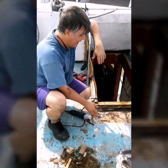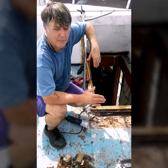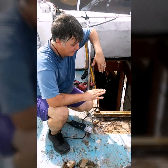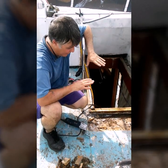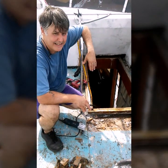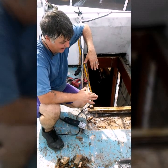The trick for me when I do the core material: I like to cut my core material to fit. I'm going to epoxy all the way around it so that epoxy can penetrate into it. Then when I put it back in I bed it into epoxy so it bonds to the glass. If you put an epoxy layer in there and push it down into it, it will actually fill up around the cracks on the sides and get a good adhesion there. Then I do the same thing when I put the top layer on.